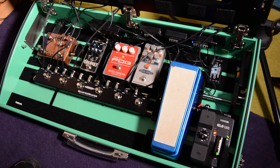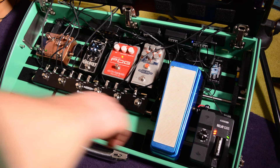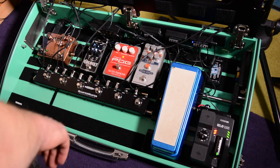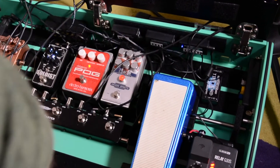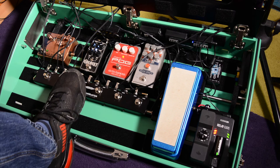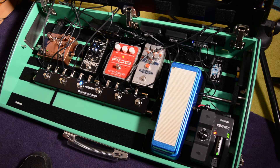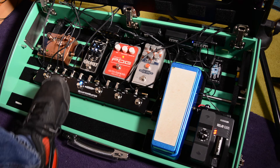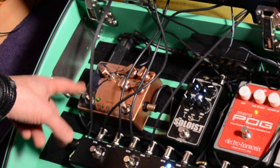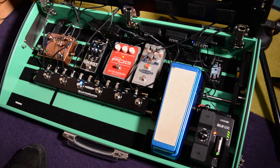Now it's in an isolated power supply. What I've got here is the Time Lord from Gig Rig, which is an isolated power supply giving us enough power from its distributor. What we're going to notice straight away — have a listen — that buzz is gone. Totally silent, no buzz at all. And if I turn on my pedal — much much quieter. Bear in mind this pedal is a fuzz, a Meathead Clump, and it's really full-on and noisy, so to be that quiet with a pedal like that is quite amazing.